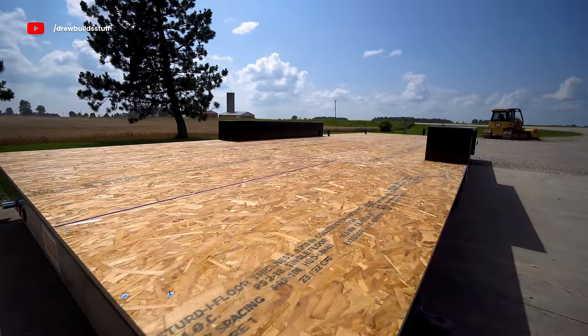Then you can just break off the dowel. And I just put a little bit of glue in these countersunk screw holes and then malleted the dowel into place. I'll come back later and cut these off and sand them and you'll barely even see them.